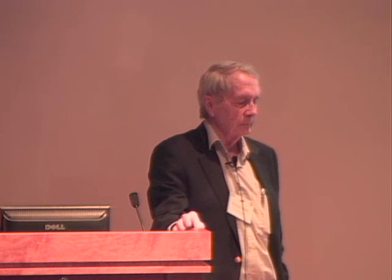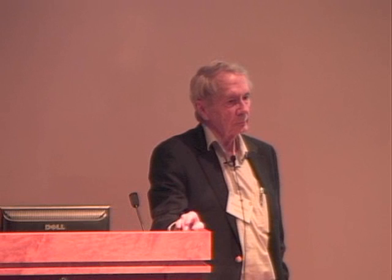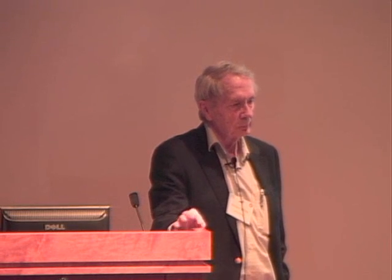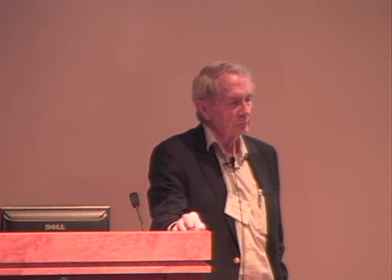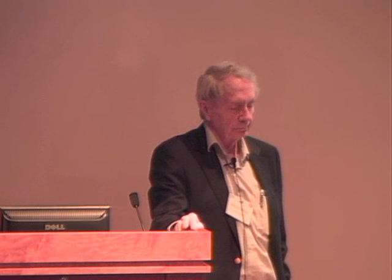And the third thing, again, is the Goubau method, which primarily looks at a combination of the CN and the semicon, because if either the CN is cut or the semicon is cut or damaged, for any reason, you will see a significant attenuation on the Goubau signal, and we are going to try that. We are going to try to cut the semicon and have a plot on that. So each of those methods addresses 3 different things, and that's all I wanted to point out.